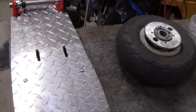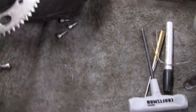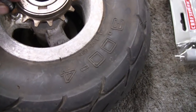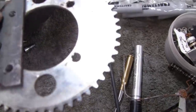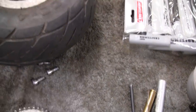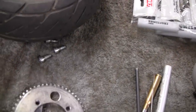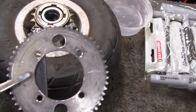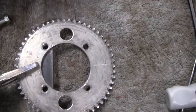Alright, let me throw this wheel back together and we'll throw it on the machine. When they had this sprocket on there, all they had was four bolts and the bolts were just sitting in between the teeth — there really wasn't much for it to grab. So what I'm doing is making a plate so I can stick it behind it. I'll cut this little section out and that'll clamp that whole side, which'll make me feel better and I know it won't fail. Right now it's just set up for failure. I already drilled the holes. Now I just gotta cut this little center out and make another one.